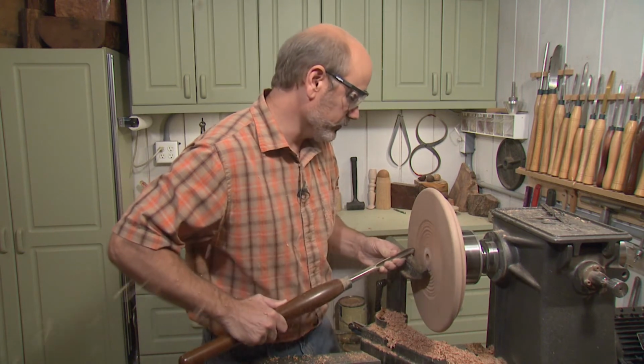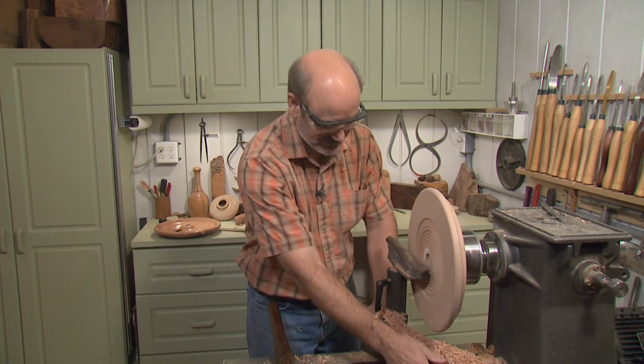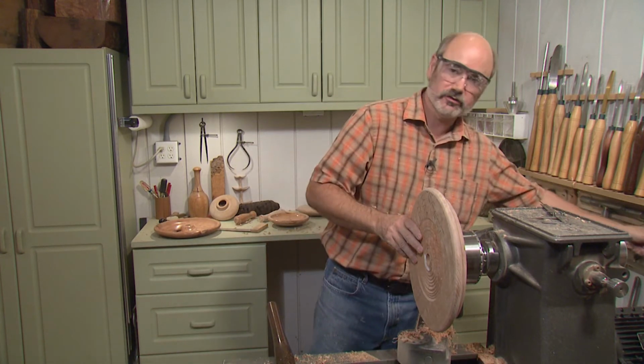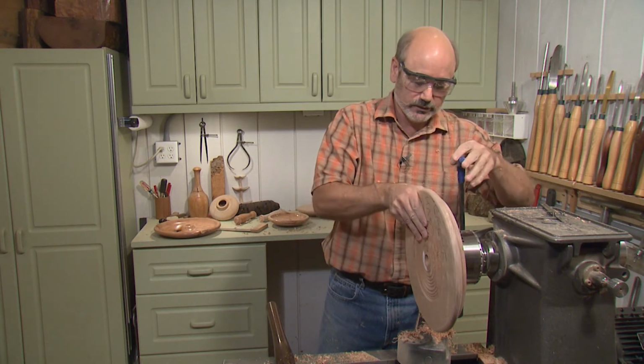Okay, now I reverse this on the lathe, and I'm just hogging out the wood. But what I went ahead and did, off camera, I went ahead and drilled the 1/2-inch hole I should have put on this end to begin with and not on the bottom. And let me just show you this real quick.